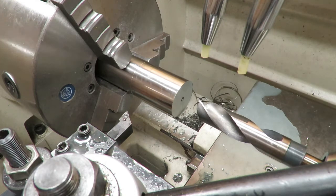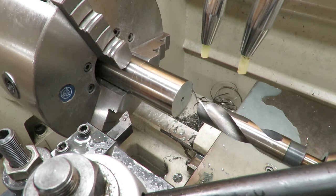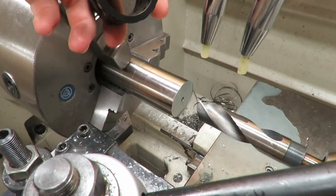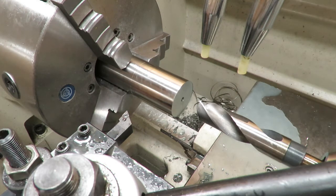We have our piece of stainless here set up. We already have it cut to the appropriate diameter — actually increased the diameter by five thousandths for a closer fit. I center drilled the end of it for a pilot hole, and we have our large drill bit here that we're going to use to bore out the inside. Then we're going to open it up to the minimum diameter of the barrel nut on this end, cut the other side to the diameter of the top of the threads, thread it, and then move on to the mill to cut the rest. Alright, let's get to it.